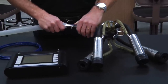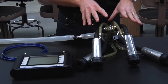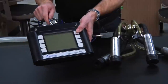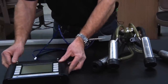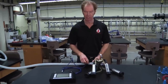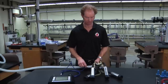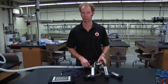You would reattach the standard milk hose that you had previously taken off the cluster. Take your sensing hose, attach it into the T-piece, and then connect it into your vacuum recorder. In this way, as the cow is being milked, you have the ability to sense and record average claw vacuum in a way that does not interfere with milk flow away from the cluster. This is one of the ways you set up for average claw vacuum.